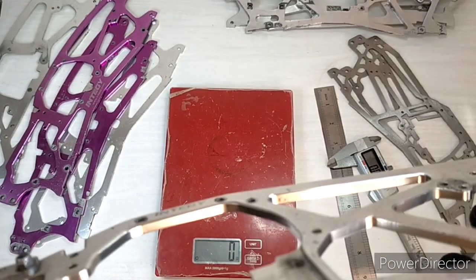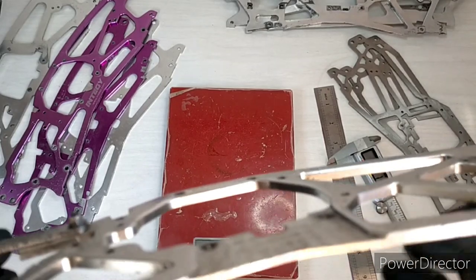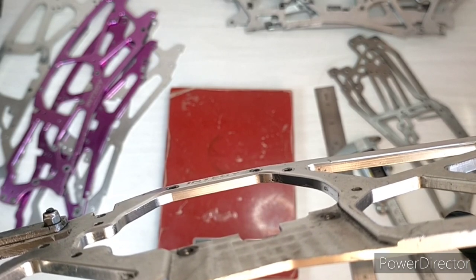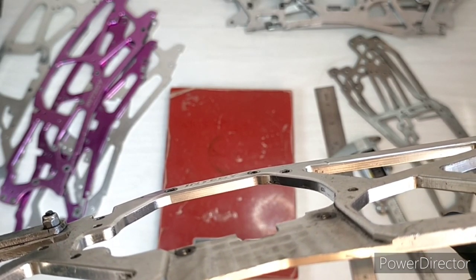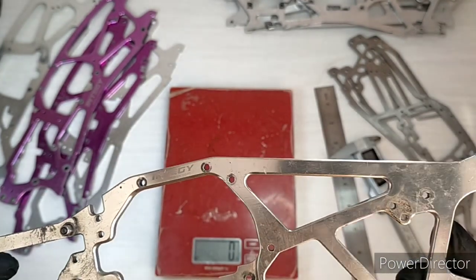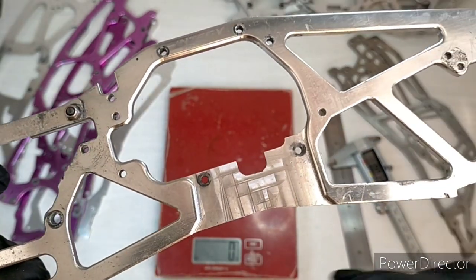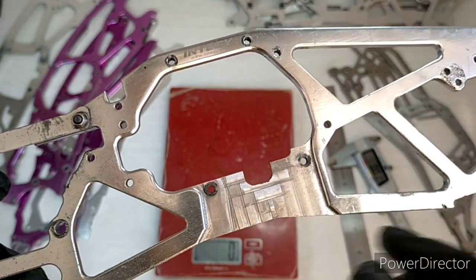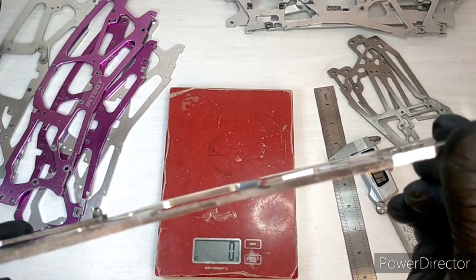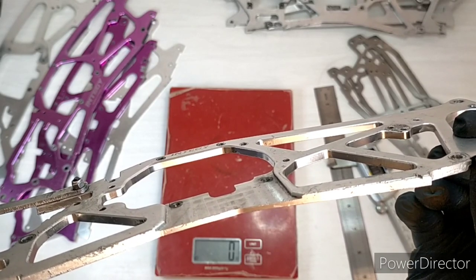Let's look at the construction. This looks to have been machined out of a piece of billet — you've got the machining marks in the edges, a chamfer, and then machining marks from the milling tools. So this has been cut out of a solid piece of aluminium, which is what they refer to as billet. There's also much more machining detail here where a recess has been put in to clear some gearbox parts.